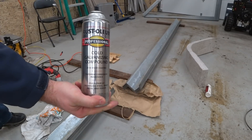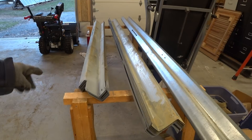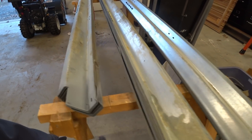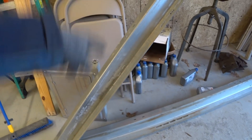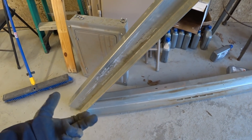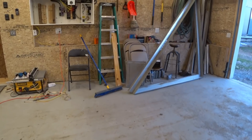This is cold galvanized compound. All of our steel is now cut. This is the back support, the bottoms, and this is the sloped section that will support the solar panels. The bottom support needs some holes drilled where it's going to have a U-bolt connect up to the five-inch pipe. Elena is going to help me and we're going to mark this out together.